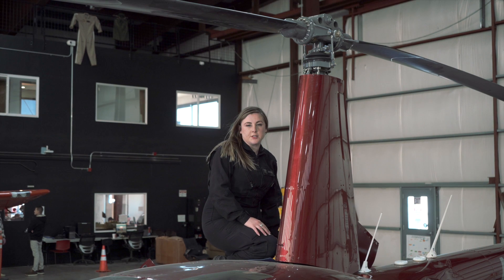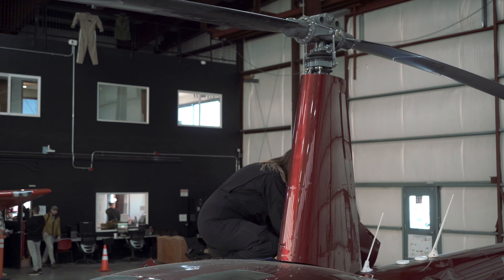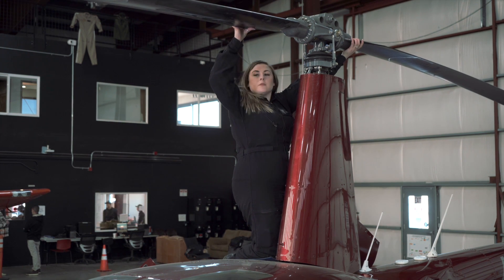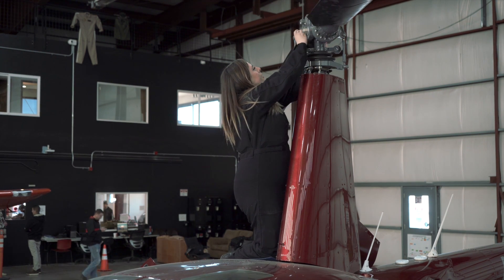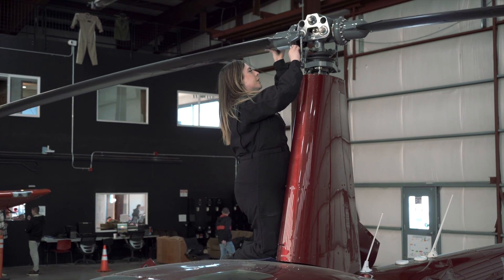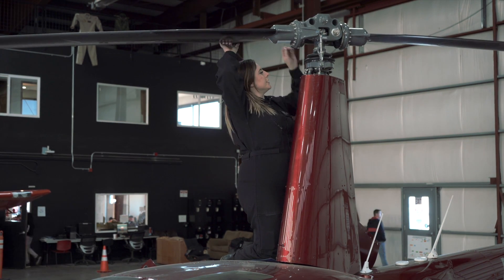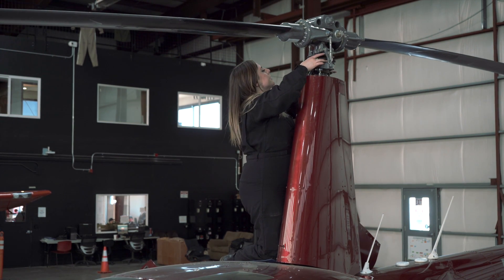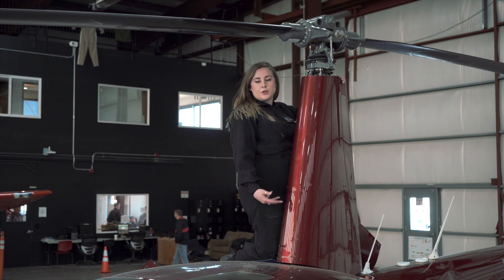Once I'm up, I'm going to visually inspect for fuel in my auxiliary fuel tank. I'm going to make sure my pitot tube is clear. I'm going to climb up and inspect our rotor hub, making sure our blades are clear before we move it, and making sure that the coning hinges and our teeter hinge — all of our bolts — are nice and secure. I want to make sure that my lower and upper scissors are free without excessive looseness. I want to make sure my spindle boots are all nice and secure, that our zip tie is intact, and that our torque stripe isn't broken.